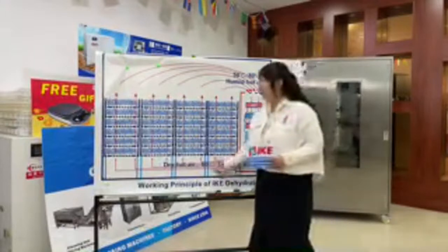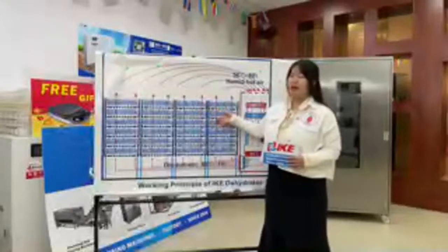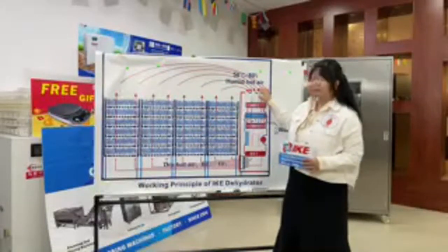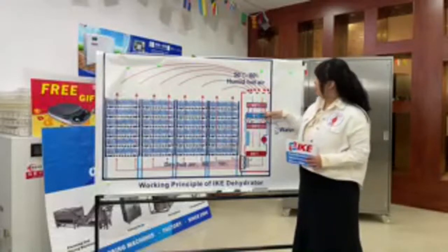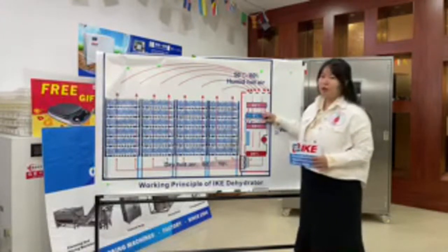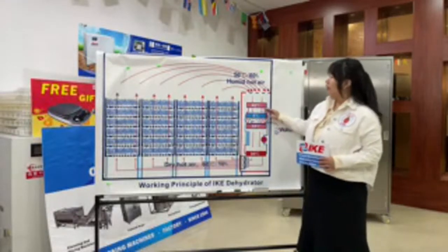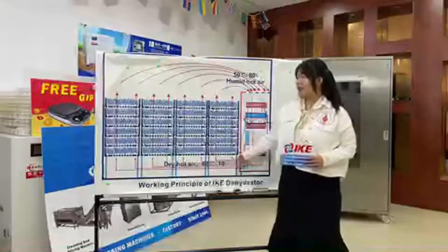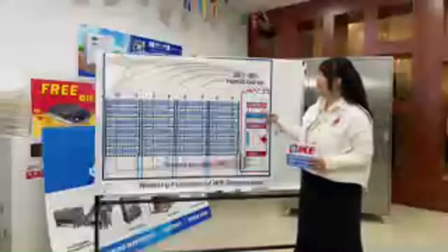Then the air will go through the trays to take up the moisture of the material, and it will become 50 degrees humid hot air. This humid hot air will then go through our 5 degrees cold panel. It will condense to water, and the water will be released out of the machine by the water outlet. After releasing the water, the air will go through the panel again and go back out. It will form a circle. This is our closed loop heat pump system.